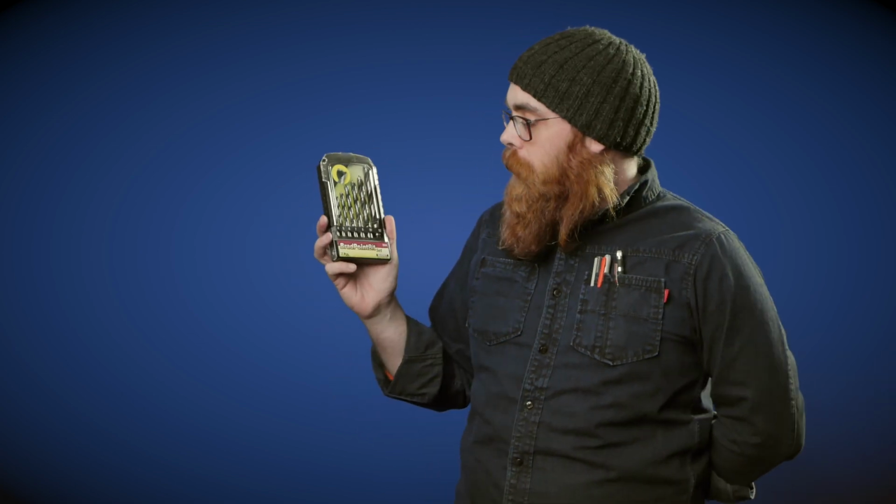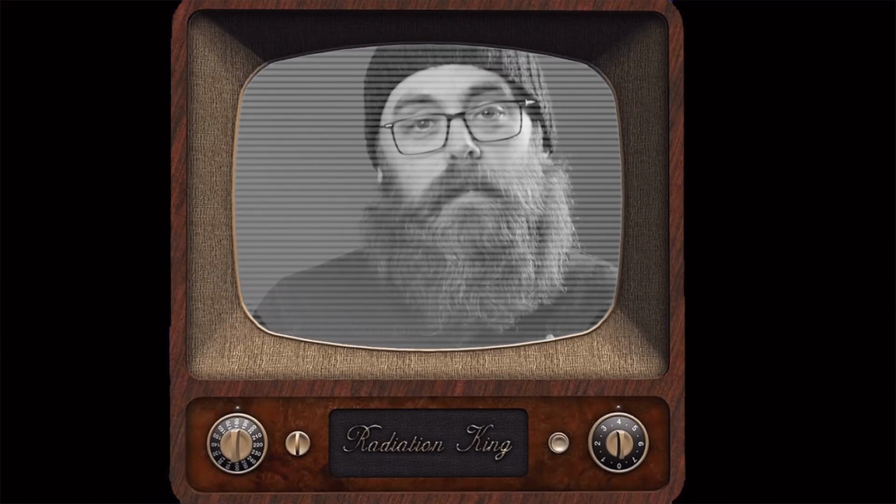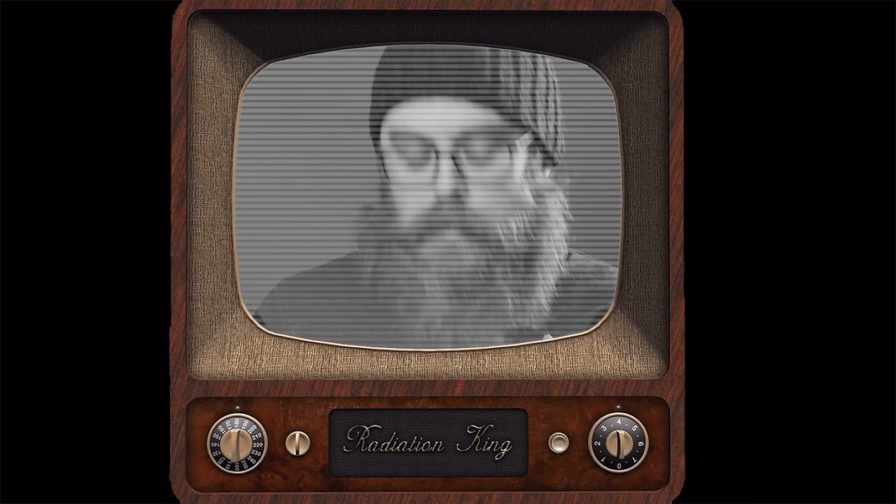Your standard set you'll find down here in Australia in most workshops is metric. Like this one, it comes in sizes 4 through 12. But if you do order stuff from overseas, particularly from the United States or from the 1950s, you might need to drill out some imperial-sized holes. There's a set for that as well. Myself, I do a fair amount of holes that are imperial size simply because the drum hardware that I purchase tends to come from the States and needs quarter-inch holes and whatnot. It's convenient to have both.